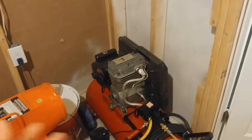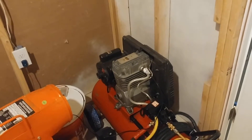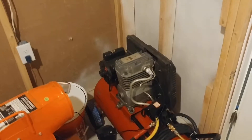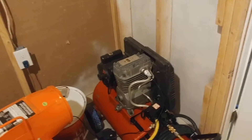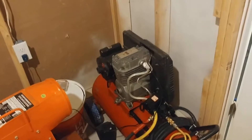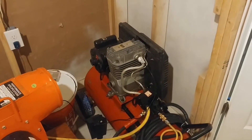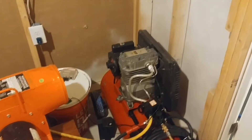I could upgrade to a bigger compressor, but for one big enough to run the plasma cutter at a good duty cycle, we're looking at $1,500 to $2,000, and I really just don't want to spend that much right now. I've been checking Craigslist and haven't seen anything. And to be honest, I've already pushed this compressor hard enough that I wouldn't feel good selling it used — the last time I changed the oil there were definitely metal particulates that probably shouldn't have been there, indicating it's already getting worn out. Anyway, I'm just going to drive it until it dies, and as long as that's happening, we may as well have some fun and do some science.